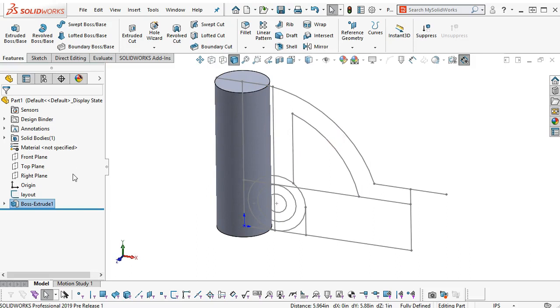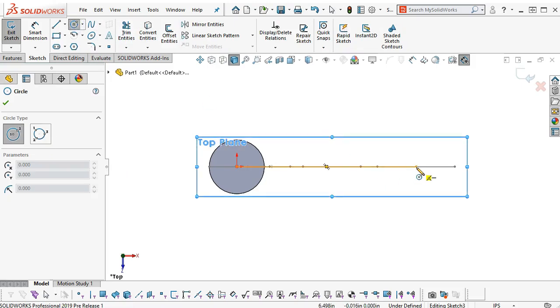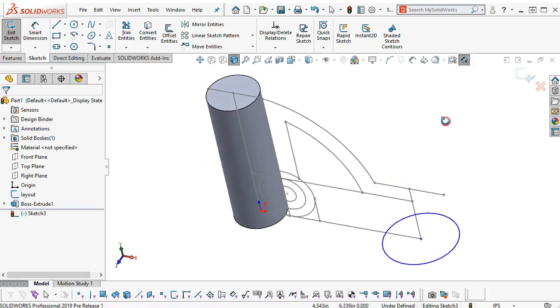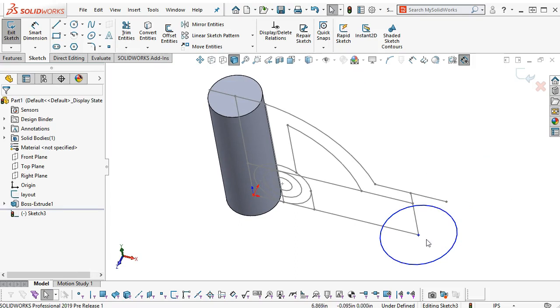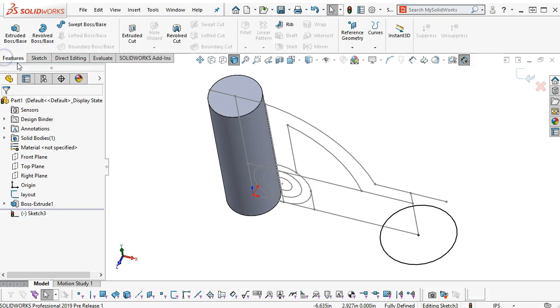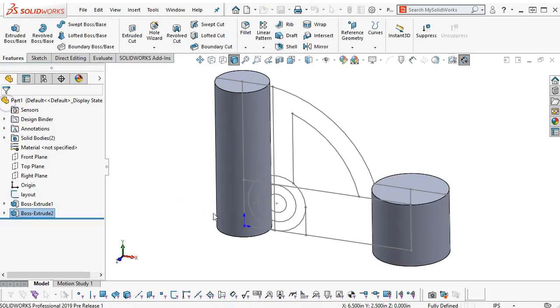Alright, so let's go ahead and if these were the same height, I would go ahead and include that in the same sketch. Since they're not, go back and pick up that center point. See if it'll let me come out to, kind of showed it briefly on the yellow, but it really didn't apply it. So there we have our coincidence. Feature extrude up to vertex. That'll get me my first base shape.